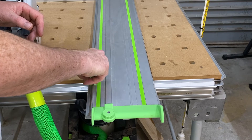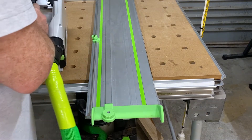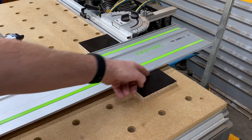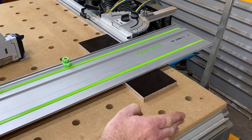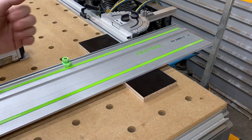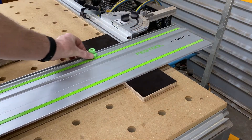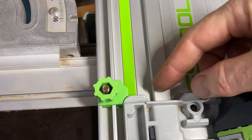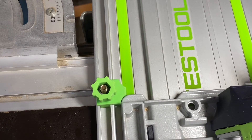We do up the nut and that acts as an end stop to stop our cut. So let's say for example I wanted to make a cut that didn't go all the way through a piece of timber, and perhaps I wanted to make that same cut several times — to make a notch for example, or for some other reason I wanted to stop a cut at a certain spot repeatedly. That's where this comes in. We slide this up to where we want to stop our cut, and the edge of the plate has a rounded portion that fits neatly into the end stop and stops us from pushing the saw any further forward.